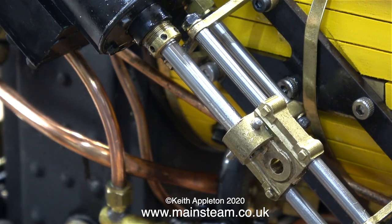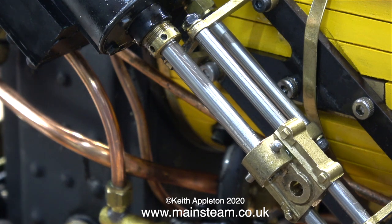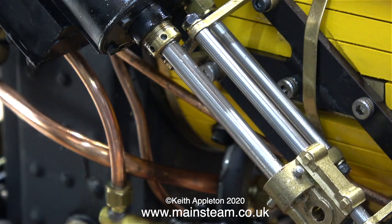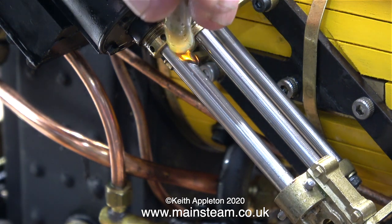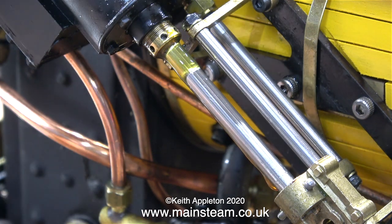To the left of the image you can see my hand moving the oil pump. I'm attempting to pump as much of the oil and WD-40 mixture as I can into the cylinders in an attempt to unstick the piston, and I'm also flooding everywhere around this cylinder with oil.